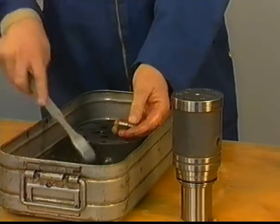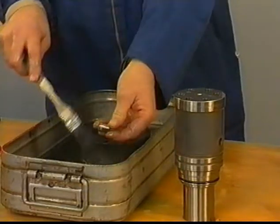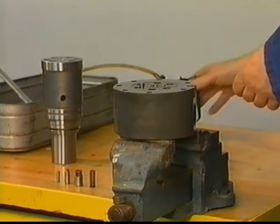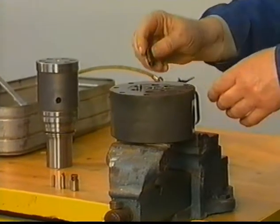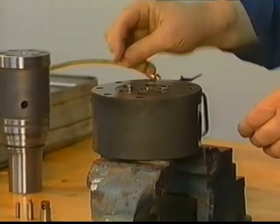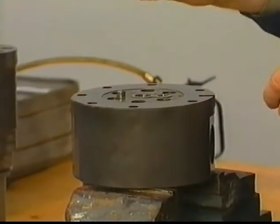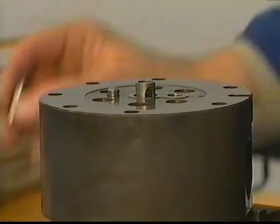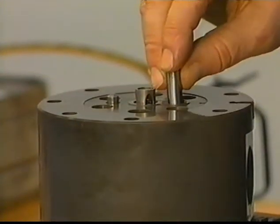Lubricate the internal parts with clean engine oil. During handling of the injection equipment components, keep your hands clean and greased with oil. Avoid touching the plunger running surface with bare fingers. Reinstall the discharge valve and constant pressure valve with their springs. Some grease may be used to keep the valves in position during assembly.